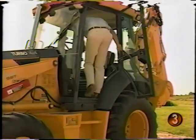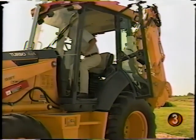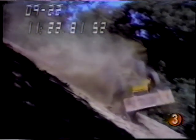As we've seen in the previous section, one of the most important pieces of safety equipment is your seat belt. Buckle up before you start the engine. The rollover protection structure by itself does not assure your safety in the event of an overturn — if you're not wearing your seat belt, you could be thrown or crushed. Don't operate under the mistaken impression that if a machine overturns, you can hold on or jump free. That impression may be fatal.